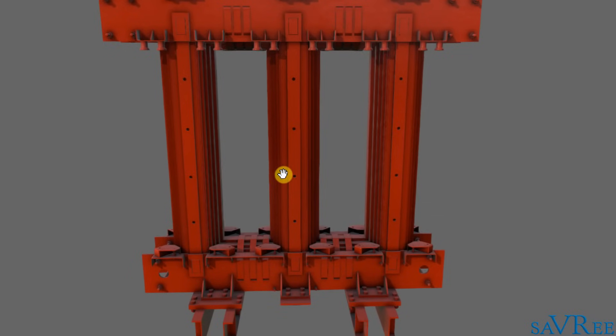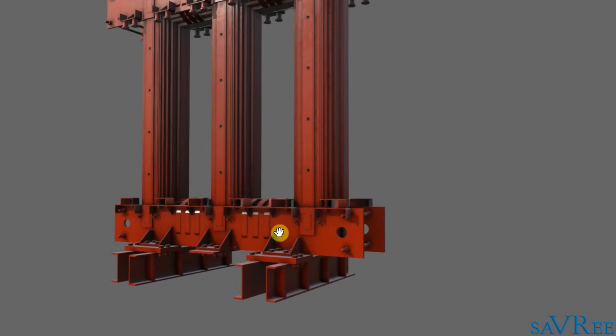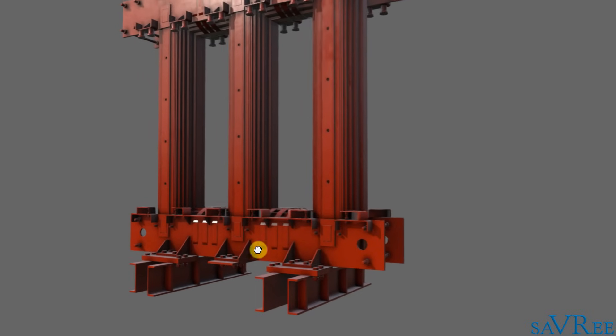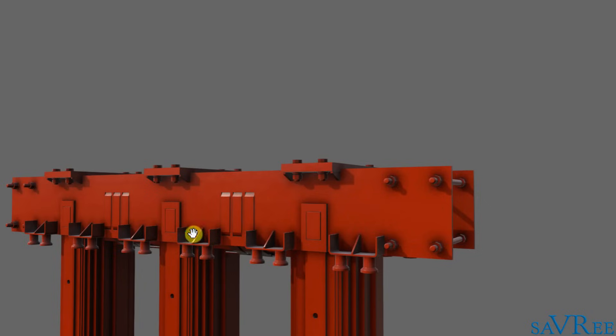So we've got our limbs — one, two, three — and we've got the yokes at the top and the bottom of the core. The core itself consists of very thin steel laminations that have been clamped together and isolated from each other, usually by using some form of lacquer or coating. Once it's all together, we clamp or glue it together — and that is our transformer core. The rest of the assembly is simply to hold the core in position, securing it in the base of the transformer so it doesn't move, and also secured to the top of the tank to stop any movement within the transformer casing.